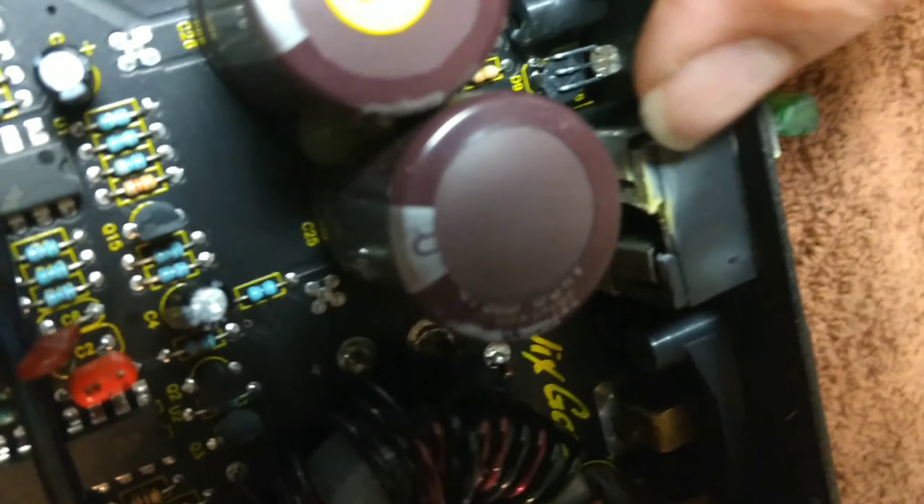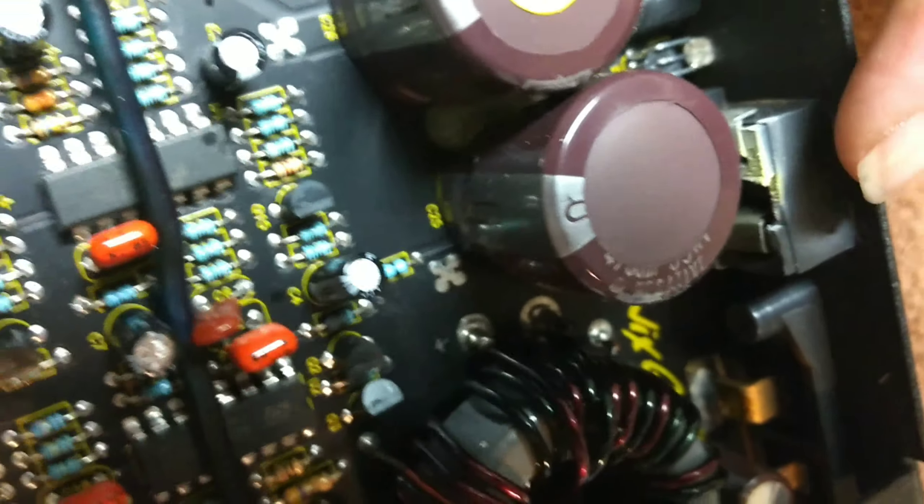Look at that — got the Phoenix Gold label on the motherboard. The caps look okay, nothing looks busted. So we're going to try to operate right there. I don't know if you guys can see where my finger is, but see that little coal — full carbon burn come out of the fuse bank? That's what we're going to be working on.